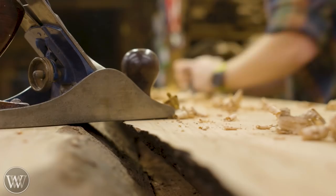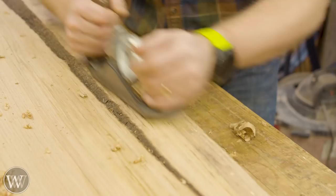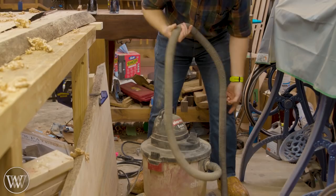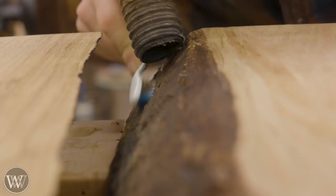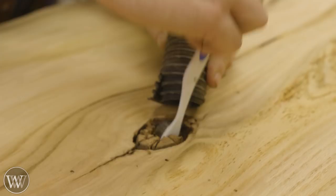Each side of the slab took about two and a half to three hours to flatten down, and I had four sides to do — so this was two solid days of flattening work, and it was well worth it. Once we get it all smooth, I pull out the vacuum to get all the dust out, because once I start putting tape down I won't have the chance to vacuum it. I'm getting into all the grooves and crevices and spending time cleaning this out. I bring in a toothbrush and a couple of scrub brushes to work into all the grain and get rid of anything loose — I don't want anything floating in the epoxy. I probably spent about 15–20 minutes just scrubbing and vacuuming, getting it as clean as possible, including inside all the loose knots.